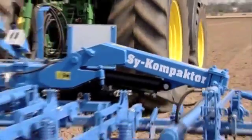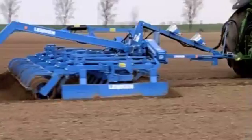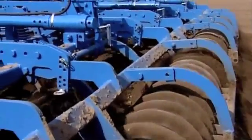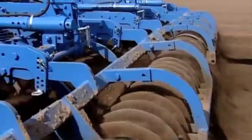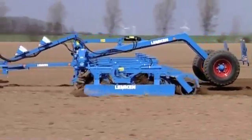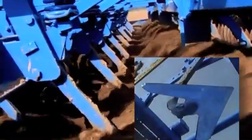The System Compactor is equipped with crumbler rollers which carry the implement frame sections and are located in front of and behind the soil loosening implements. There is therefore no pressure on the implements in between, allowing them to precisely maintain the working depth. The wing shares are slightly angled to ensure vigorous soil penetration, while their grooved undersides allow shallow seedbed preparation without clogging.